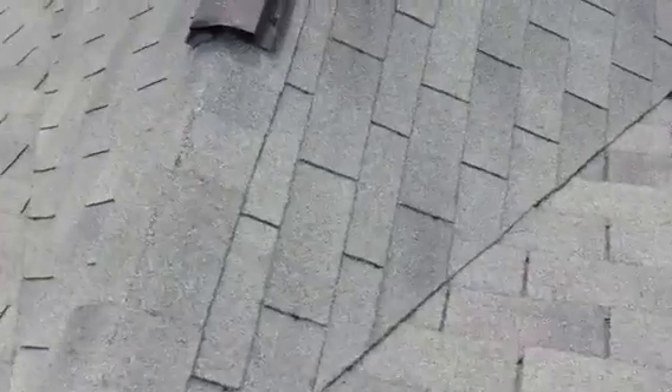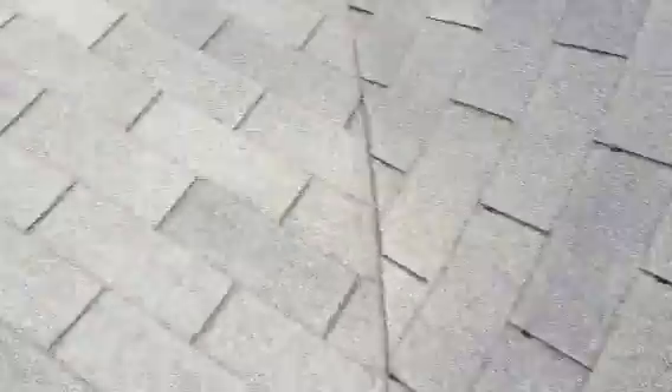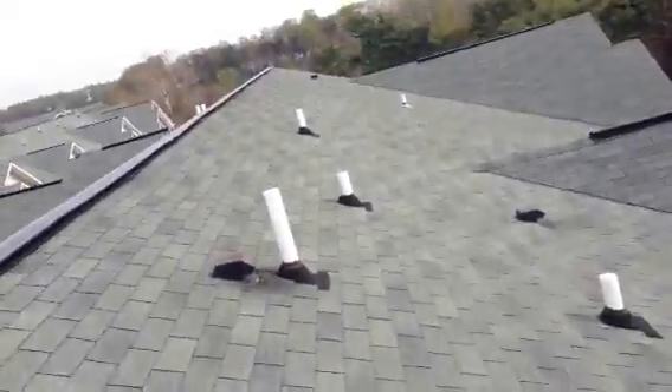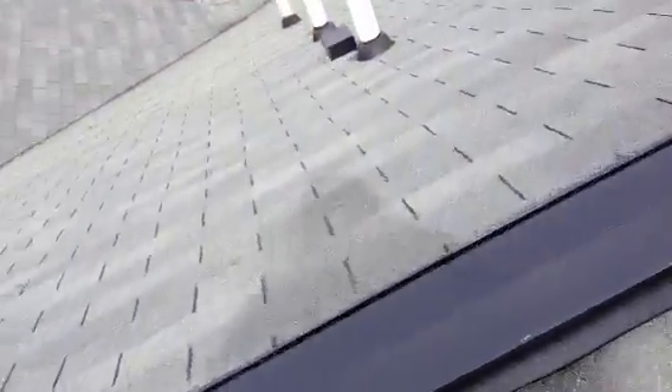As I keep going, this section is new. This is old ridge vent with no end caps — get that sealed. On this section we've got five three-inch pipe collars that need to be replaced and three hood vents that need to be sanded and sealed.